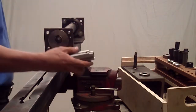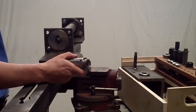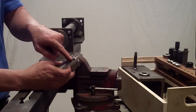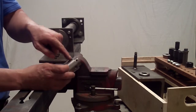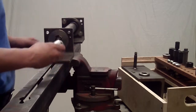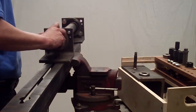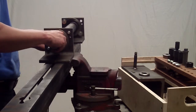This is the water pump bearing puller, and it's also the driver to drive the new bearings in. We're going to use the 1/4-inch hole that's on the large diameter of the tool whenever possible, as opposed to using the hole that's up near the nose of it. Our 1/4-inch pin, and turn it so the pin is horizontal.